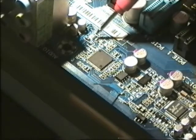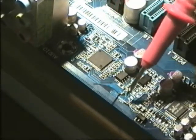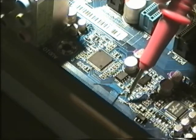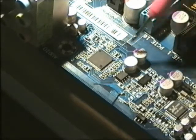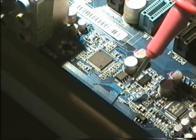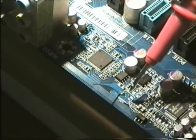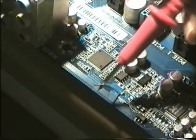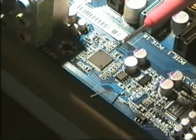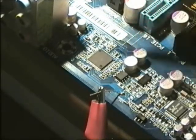That's where the inductor was — across here — I think they've denoted it as LL1, yeah. That's the missing inductor there. It was meant to drive the base here, but who knows what's happening, because the base drive doesn't appear to appear anywhere else. There's clearly an open circuit. I was thinking I could just pop something like an LM317 in there with a couple of control resistors back to 1.8 volts.